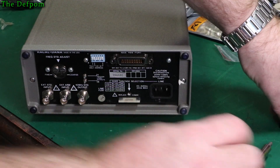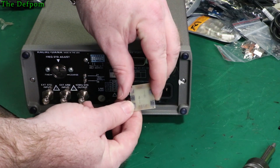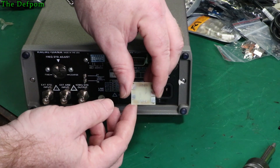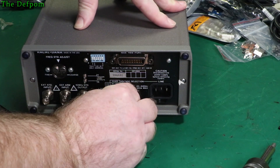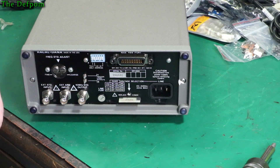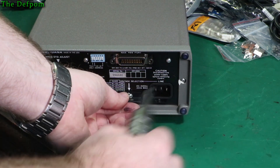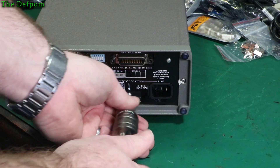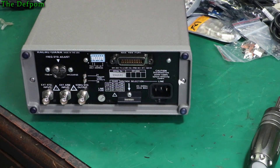It's set for 120 volts so I need to change that before I power it up. There's a retainer clip — you pull this card out and you can see it's set for 120; I want 240 volt. I'll spin it around and that will give me 240 volt. I do love these kinds of voltage selector connections — so much simpler than messing around with jumpers, or opening up and changing wiring. I'll plug it in and power it up and see what happens. I've already noticed it definitely needs repair — no doubt about it.